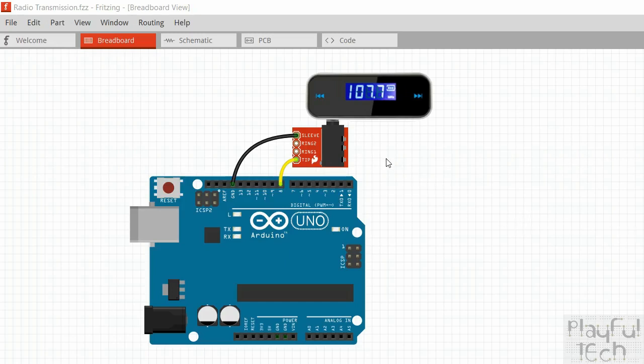It's nice and really straightforward. I've got the FM transmitter plugged into a 3.5mm breakout module, which exposes the different contact points of the audio jack into pins you can easily wire into an Arduino. The outermost part of the jack — the sleeve — goes to ground, and the tip goes to digital pin 8. I'm using the tone function of the Arduino library to generate a square wave on that pin to create the Morse code audio. Ring 1 and Ring 2 are not used — those would be for stereo audio.